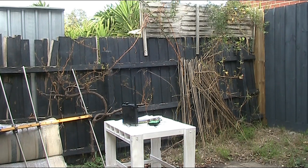Now, this particular one, it just showed the concept worked. It's possibly not very practical, although I did try it with a dipole instead of a beam, and it did work, but the range was even less. Now, if you had a bigger beam, or better still, maybe you're trying it on UHF, on 70 centimetres, where you can have a beam with more elements and more gain, then it might be a more workable concept.